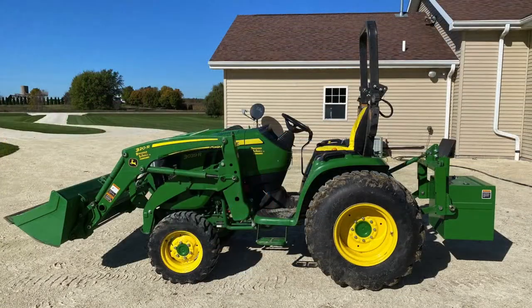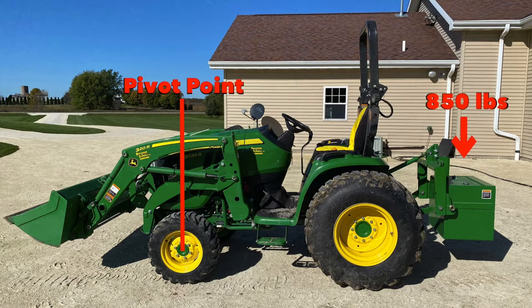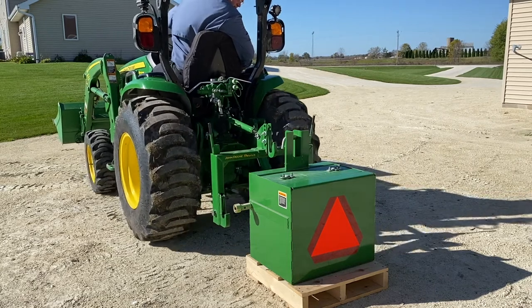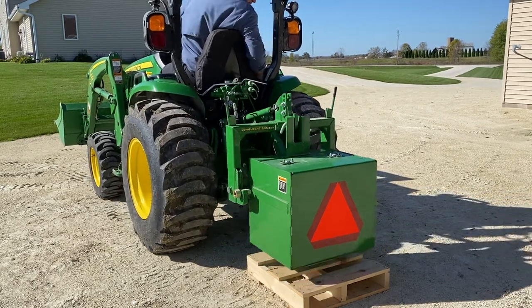To give you a quick rundown — looking at the tractor from the side, it's pretty easy to see where it'd be valuable to have weight in the back. You're looking at a pivot point of your front axle, and remember speed, slope, turning angle, and how far things are in front of you all affect your tractor's ability to keep its back tires on the ground. With 850 pounds in the back, you're going to be a lot safer. Basically any time I'm doing heavy lifting with the front, even simple stuff like loading a trailer or moving dirt, it's really nice having that weight back there. It stabilizes everything.